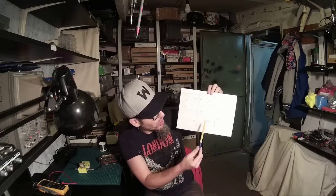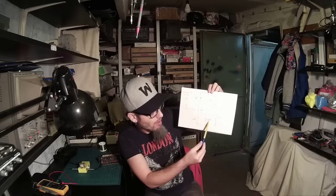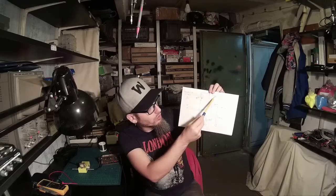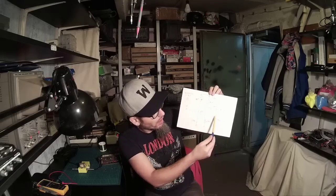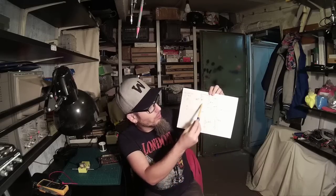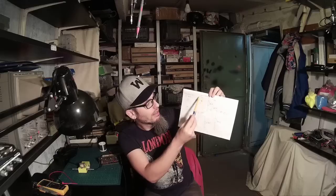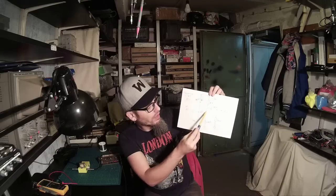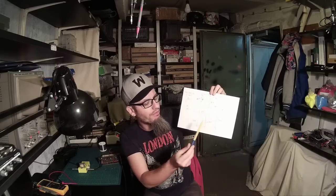The only thing that has changed is that you have the collector tied to ground with a 470 ohm resistor. You have a 10K in the emitter, which is tied to the minus V supply. There's an output capacitor, a load resistor of 100K, and a 500K trimmer. I recommend you use a trimmer here because you have to trim the voltage.